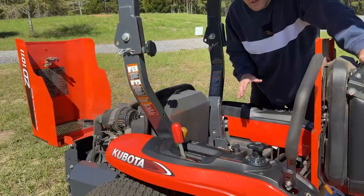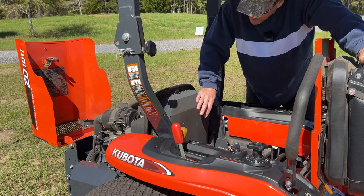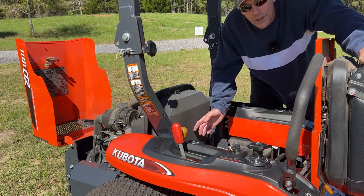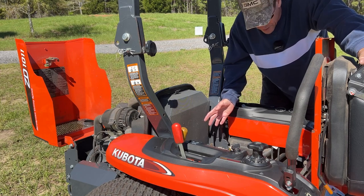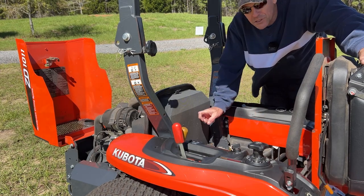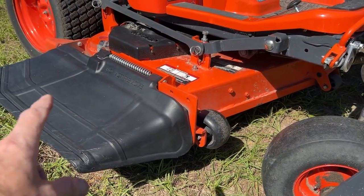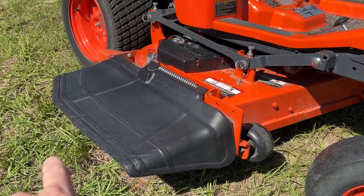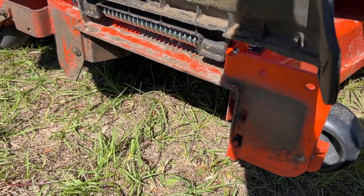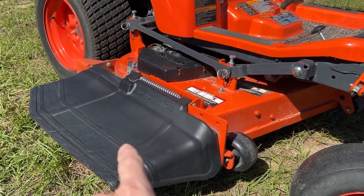An important feature is keeping the radiator clean. Kubota has placed a fine mesh screen in front of the radiator that's easy to brush or blow off, preventing debris from clogging the fins and causing overheating. You should always monitor the temperature gauge, as overheating is most likely caused by a debris-clogged screen. Kubota offers the mower deck in two configurations: right discharge and rear discharge. This is a right-discharge model, and there's an optional operator-controlled discharge chute that mounts to the right side and allows the operator to close off the discharge near flower beds.